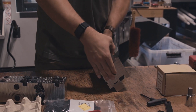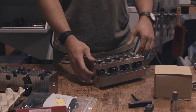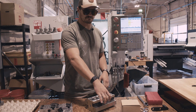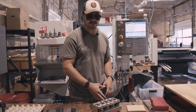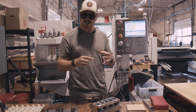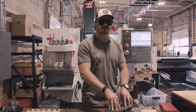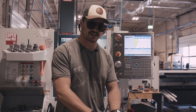That's what makes the tombstones so useful. On our five-axis machine over here, the DMG Mori, our plan is to make palletized tombstones that can do one or more cases per side. So we'll have this set up with multiple cases on each side that can rotate in five axes, where we can come in, do the case tubes, do the holes in the lugs, and actually reduce the amount of operations from five operations on a three-axis mill to two operations on a five-axis mill.